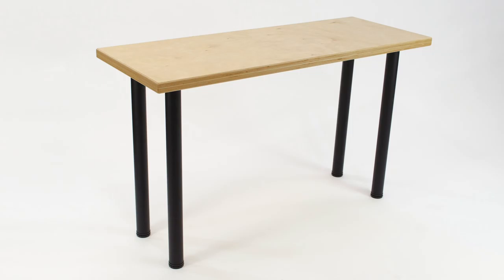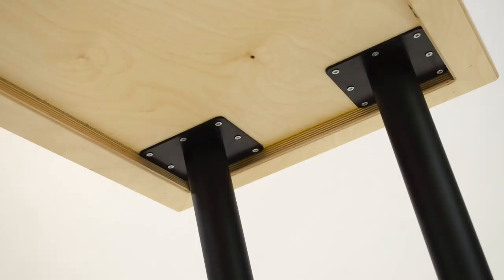It was a simple desk — the legs were purchased online — and I had quite a few people asking about its stability, as far as racking from side to side. It is actually very stout. Those brackets were thicker metal, bolted up real nice, and there was really no issue with racking either side to side or front to back. I would say that's about as shallow as I would go for that type of desk — I believe it was 18 inches. I wouldn't go any narrower than that; the legs front to back might be a bit close together.